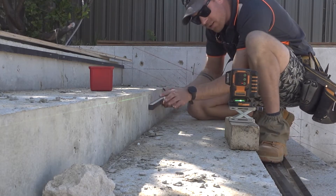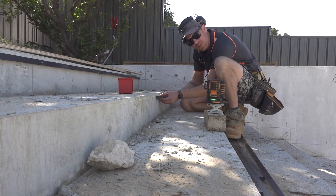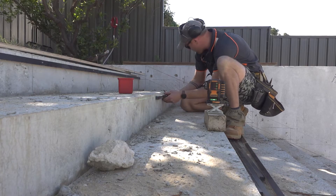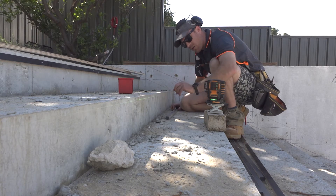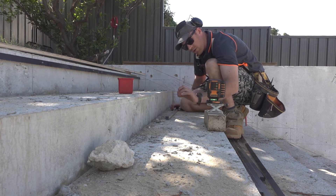I am slightly concerned that this piece of ply won't come out when we strip. It should come out because we've got two separate pieces here — it should slide out. Because I'm using concrete nails, I'm going to nail this in. But concrete nails chip the face, and because this will be seen, I'm only going to embed the concrete nail a tiny bit.